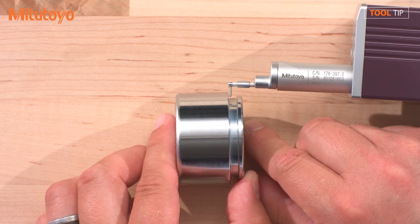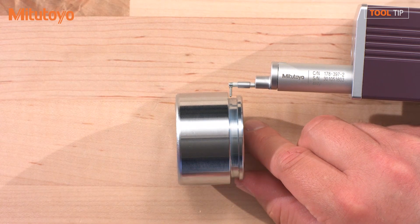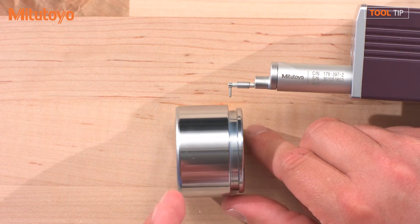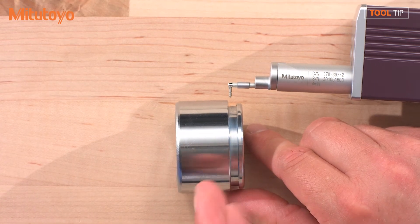So if I have a part with a groove that's a little deeper or more narrow, is there some flexibility in the type of styli I can use? Absolutely. With both the skidded and skidless systems, there are different styli that can be used. If you need to reach deeper within a part or down within a groove, maybe at a little bit of an angle for a gear tooth, we can accommodate for that. There are more styli options available for skidless systems than for skidded systems typically.